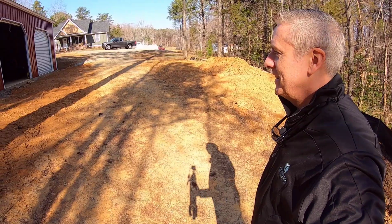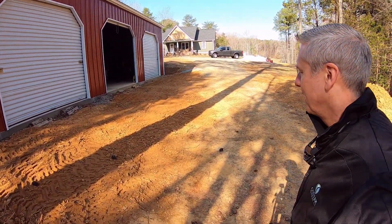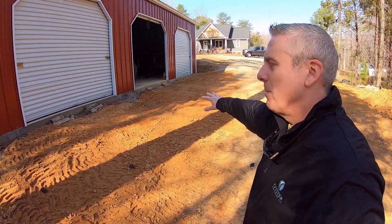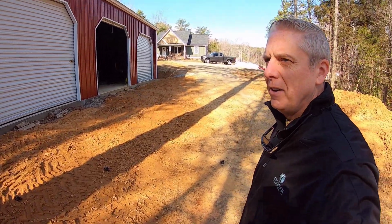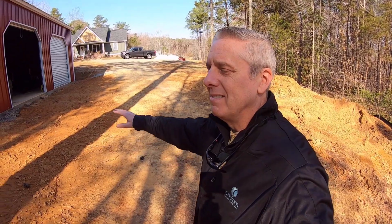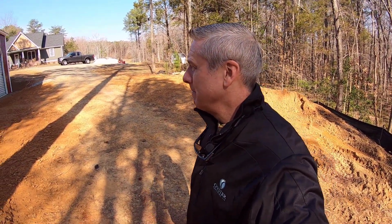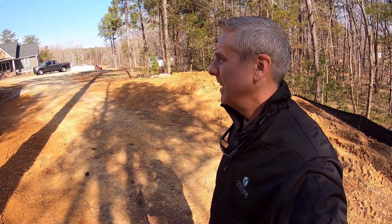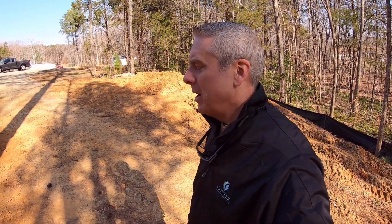Basically, you saw last week I started a kind of practice run, if you will, to see if it would work out and I could do it okay. I brought a bunch of dirt up here and started to bring it up a little bit. I don't have a tamper or a roller, nothing to help flatten it down well. So I'm going to do my best just to keep going back and forth with the weight of the tractor. I think it's about 4,000 pounds, plus I'm going to throw the box blade on the back of it, and that'll add probably another 500.